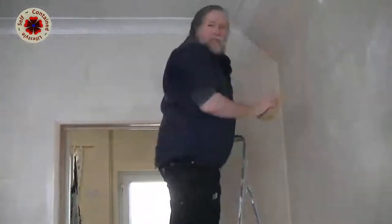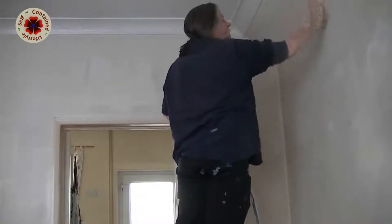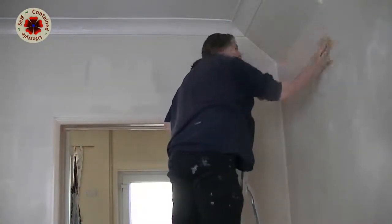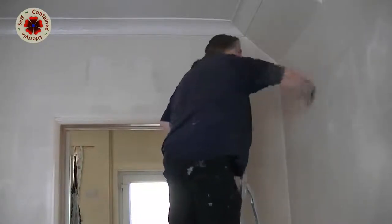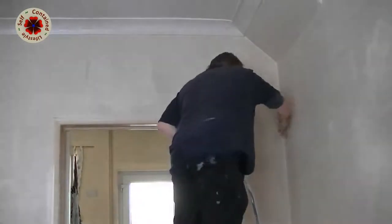I've just sanded down all the walls and now they're dusty, so I must take some sugar soap. Remember, it's 250 grams to about four to four and a half liters of water. Mix it in a bowl, wear rubber gloves, and protect all your surfaces where there are going to be splashes because this stuff is quite strong. I'm going to wash the walls — it's a simple job, wiping from the top to the bottom, taking all the dust and grease off. Always work from top to bottom so you can pick up the runs.